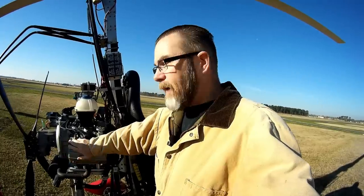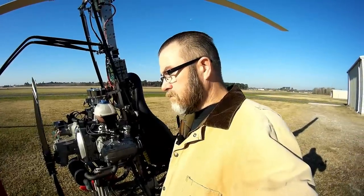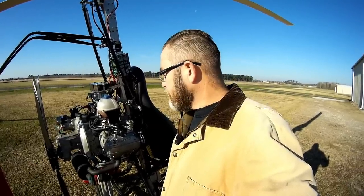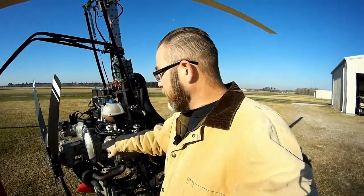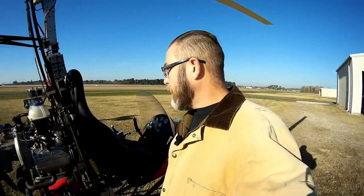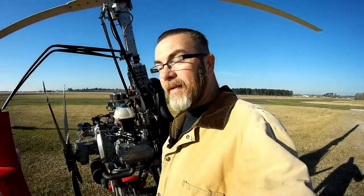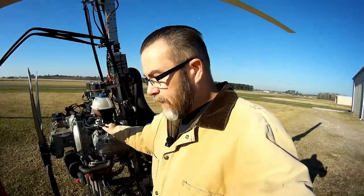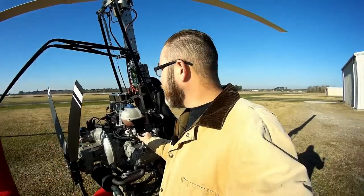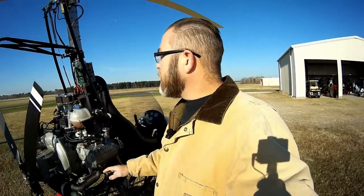I did have the heads rebuilt. There wasn't really anything wrong, I just wanted to have that peace of mind and get them in tip-top shape. So I've got new head gaskets, new cam tower gaskets, valve cover gaskets, and all that. New timing belts. I had to learn the timing sequence on the Subaru motor. It's a little different than a small block or big block Chevy that I'm used to, or a Volkswagen. So anyway, the engine's working well.